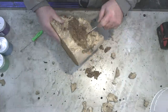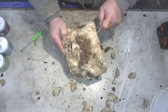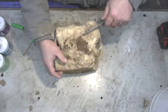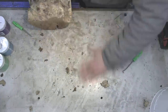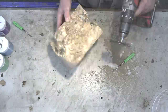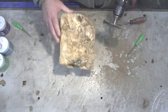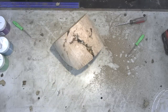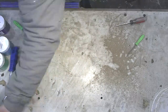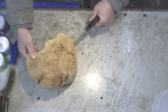The bark comes off this quite easily. It's a good thing about burl that's cut in the summertime — usually the bark doesn't stay on when it comes time to run it through the kiln. Once the majority of the bark is gone, I switch over to a brass brush in my drill. It's the best way to get down between those little spikes and nubs. Then do a good job blowing it all out so you don't get any floaty bits in your resin.